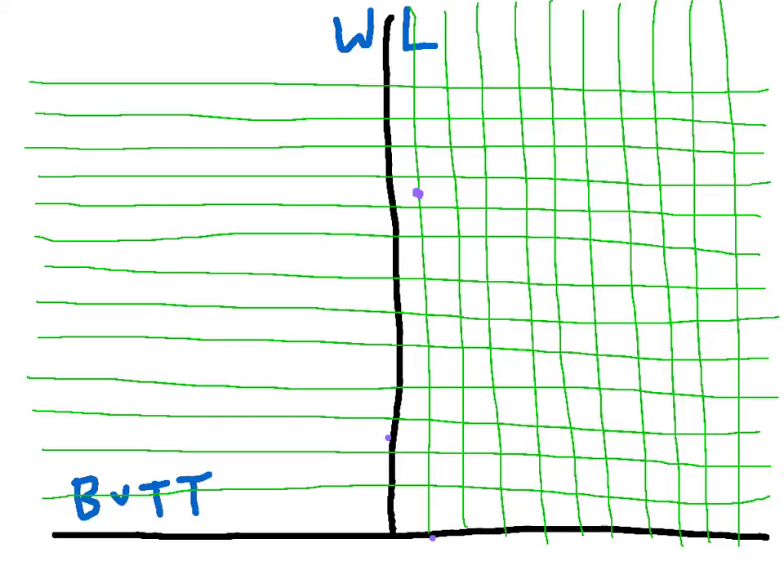The next one is for the four-inch butt line, and that is listed as one foot, six inches, and three-eighths. So at the second vertical line to the right of the origin, I need to go up 18 inches and three-eighths. I'm going to go up two, four, six, eight, ten, twelve, fourteen, sixteen, eighteen — so 18 inches and three-eighths.